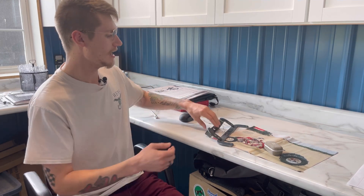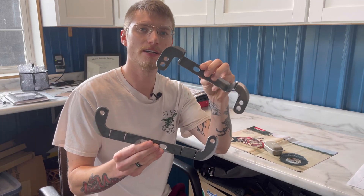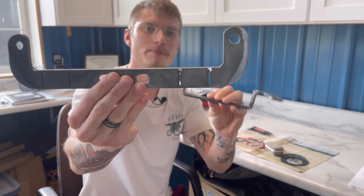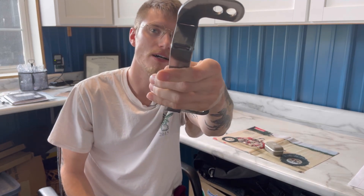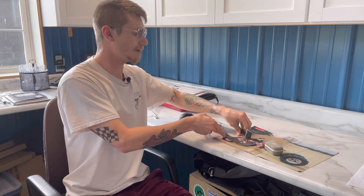I hope you found that video helpful and entertaining. If you did, hit that thumbs up button for me and subscribe for future videos. We've started getting into making formed parts by simply cutting slits into the bracket, putting it in a vice grip, and bending it to form what we need. Then you can go in and weld these slits to give it the strength. Feel free to comment any questions you have.